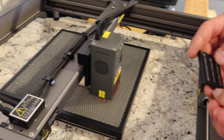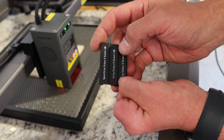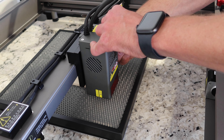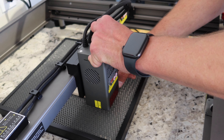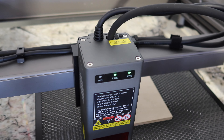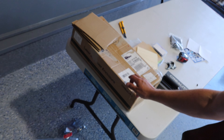Here is our test piece. This is at 400 millimeters per minute up to 9,000 — I just made those numbers up to get an idea of what happens. We're cutting through at 46.7% power all the way up to 100% at that speed. Now we're playing with the engraving option. I've tossed my logo in and watched a tutorial on YouTube. We've got a piece of 4x4 inch stainless steel in there and we're just printing the logo to see what the outcome is.